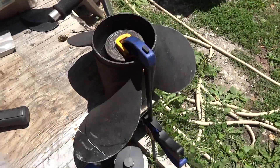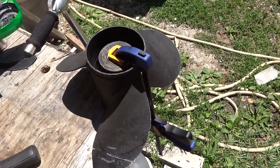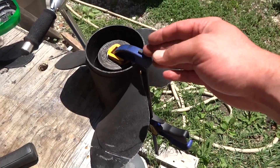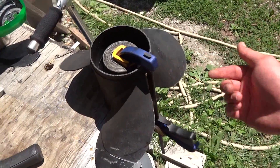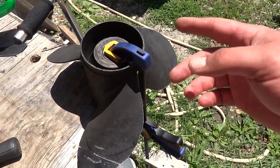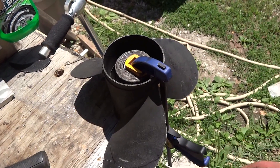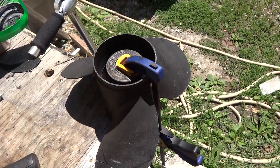The reason why you would want to do something like this is that they have test wheels, and the test wheels are normally for a certain horsepower. This will work on a wide range of motors. It will allow you to put it in a test tank without putting too much pressure from the thrust of the propeller and causing the water pump to cavitate. Next thing you know, you're sucking air and running the thing dry and overheating your motor. And it will help you put a little bit of load on your motor to find out where your idle setting is.